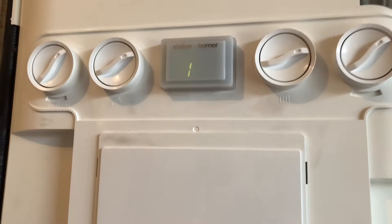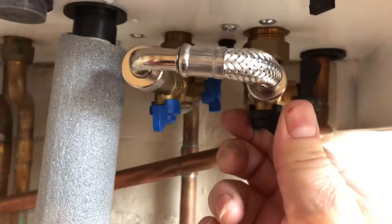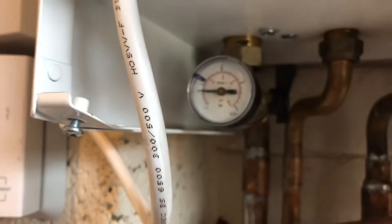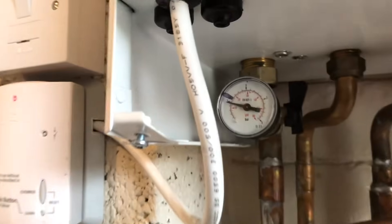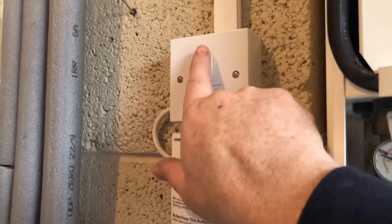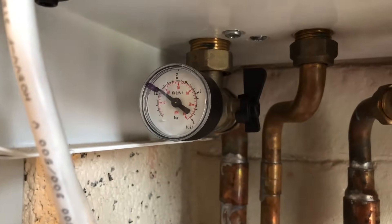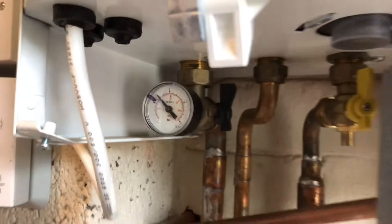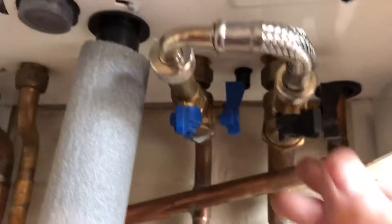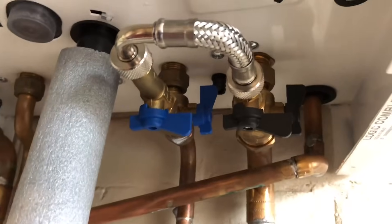The display is showing F1 and the gauge is going up, so I'm just going to open this a bit more. The boiler has actually fired up, which means the fault code has cleared. I'm going to switch the boiler off now just so we can finish without the power on. We're just above where we want to be — the pressure will drop down a little bit as we use it. Turn that valve off fully, then turn this one off fully.